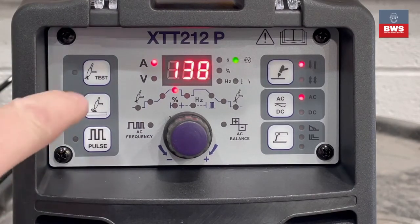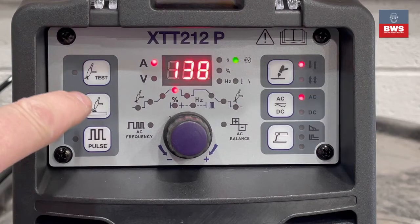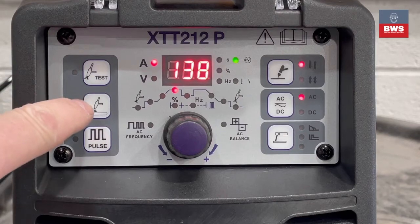The next button is the HF high frequency button. High frequency is what enables the arc to jump a gap so that you don't have to touch your tungsten onto your job. Unless you're in an environment where you can't use HF — i.e. there is some sensitive electronics about — I would always have this on. Switching it off is only applicable in DC mode for steel. Switching it off in AC mode for aluminium means you just can't weld, as for AC you need HF continuously.